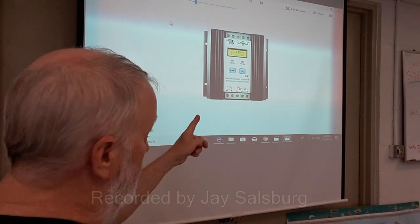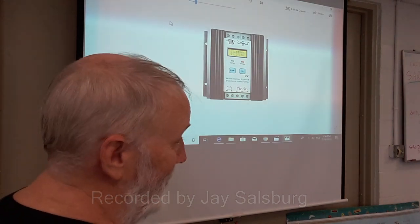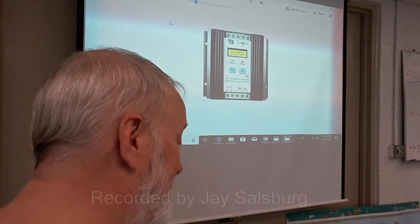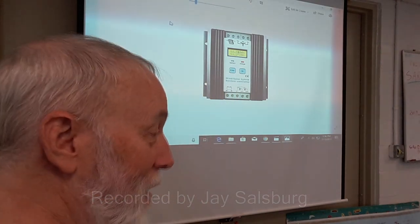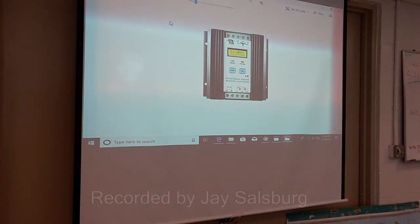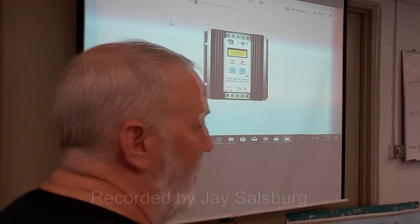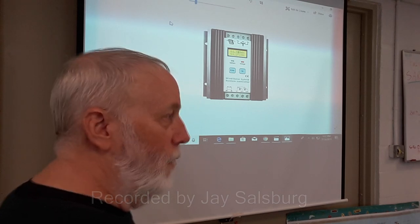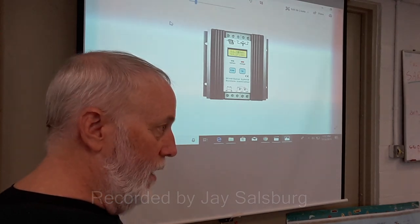So you can't do that, but legally. The power companies have legislated us out of freedom. Well, no, it's not that. Safety reasons. If you just plug it in and the power goes out, you backfeed the grid. If somebody's working on it, you get electrocuted. Well, that's why you have to have a disconnect.